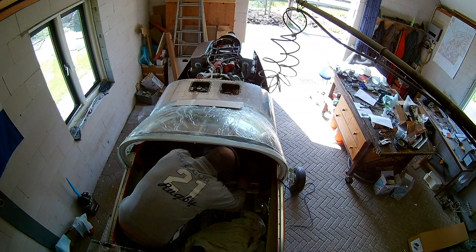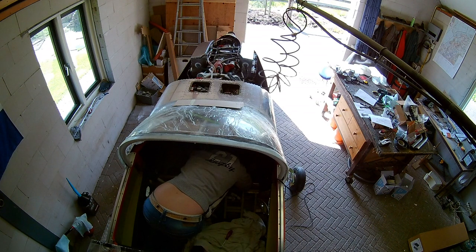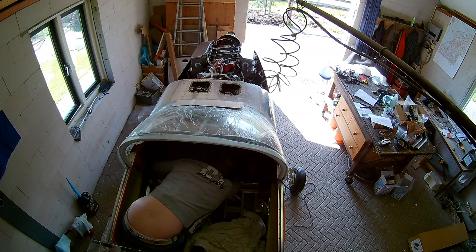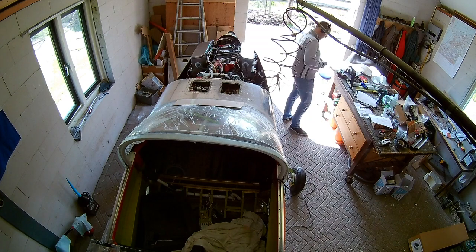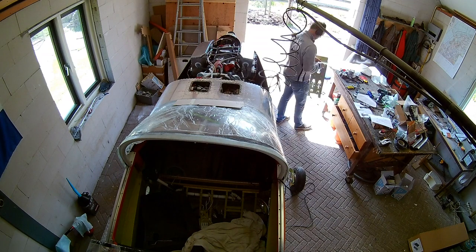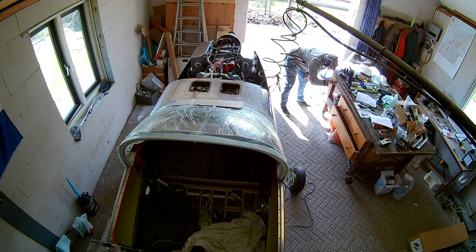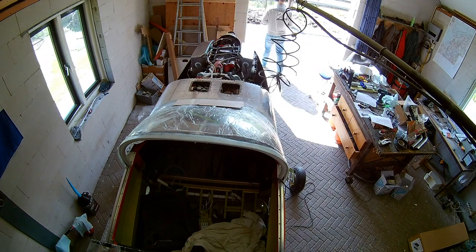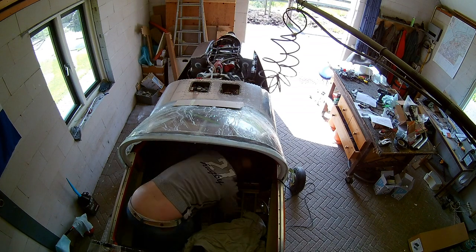I decided not to use the standard fuel system brackets that you can install on the firewall or some other place, but instead trim out the same profile from the bottom plate between the two rudder pedals in the RV-7. This limits the height of the fuel system and it saves a lot of space, and a little weight of course, but it results in some extra work because you have to do the cutouts all yourself. Especially the connection to the fuel bulkheads through the firewall is a lot of work, because again the space is cramped and it's a very tight fit, so it takes some extra care to make that correct and of course also leak free.